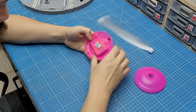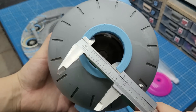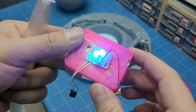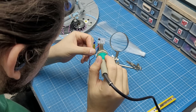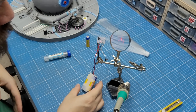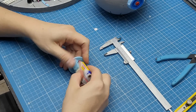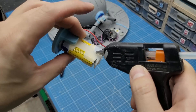Now let's work on the lights. This is a super cheap lamp, so taking it apart was very easy — inside there's almost nothing, which I think is good news. I took measurements from the battery container hoping to keep it as-is and fit it through the bottom, but I quickly decided to switch to a two-battery holder that's smaller and much better built. I had to desolder and replace the battery holder on the circuit board, and despite being very bad at soldering I managed to keep everything working. I then 3D modeled some pieces to keep everything nice and solid on a single structure, using hot glue to create a sort of miniature lighthouse.